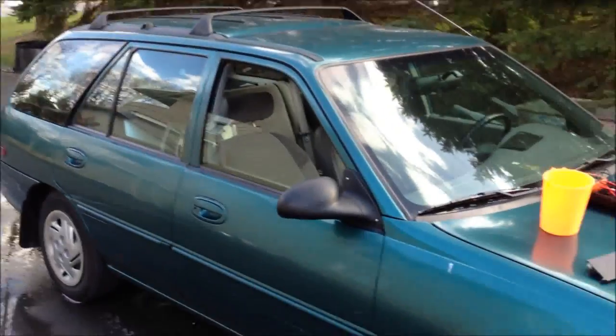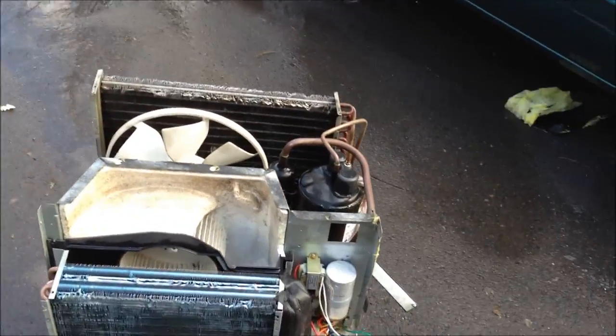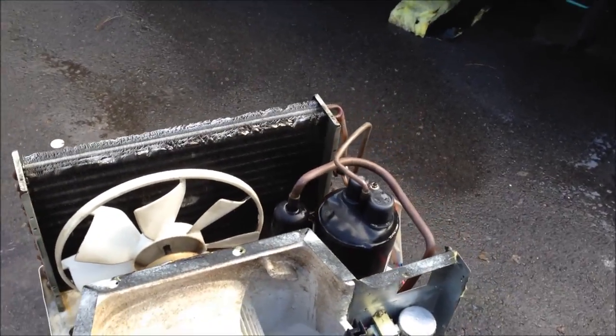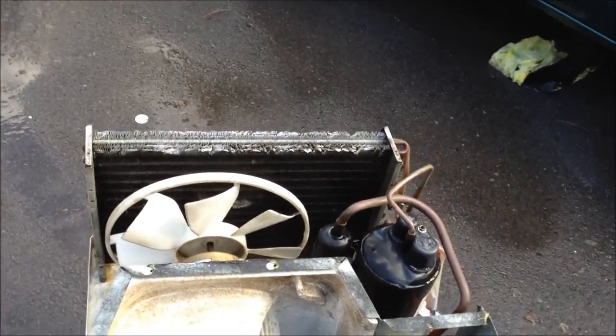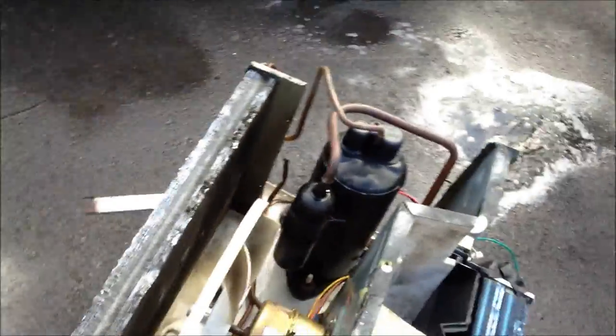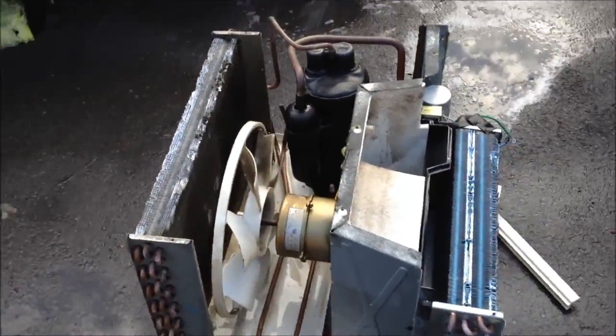You're going to say, 'I don't know what's in an air conditioner, I don't know how to clean it.' When you clean your car, do you know exactly every part in it? No. You don't have to know exactly what's in an air conditioner to clean it. It's about six screws — pop the outside cover off and just hose it out. You don't have to use soap; just use common sense, don't get your controls all soaking wet, and if you do, let them dry out. Don't chop anything or jar it around too much. It's not hard — anybody can really do it.